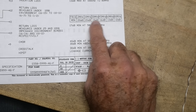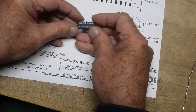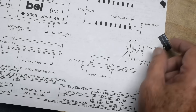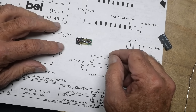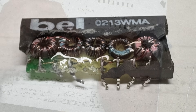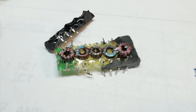It says here it's good to 2 MHz, 10 MHz, 30 MHz, 80 MHz. Kind of a funny little part, and this is what they look like. Here's one that I opened up — it's been opened with a chisel and hammer. Inside are a bunch of little coils, and it's all just kind of gooped over with some silicone, then put in a plastic epoxy package. So it's a little PC board with a bunch of chokes and transformers in it. No active components.